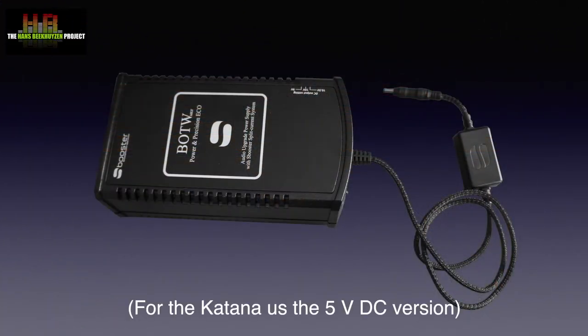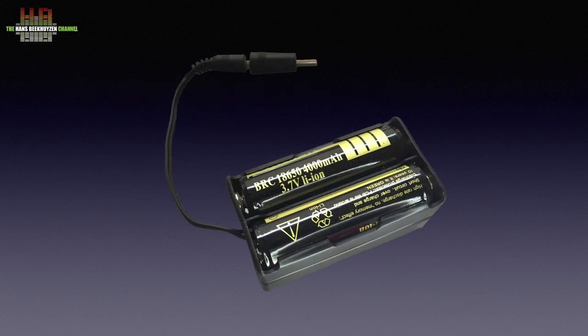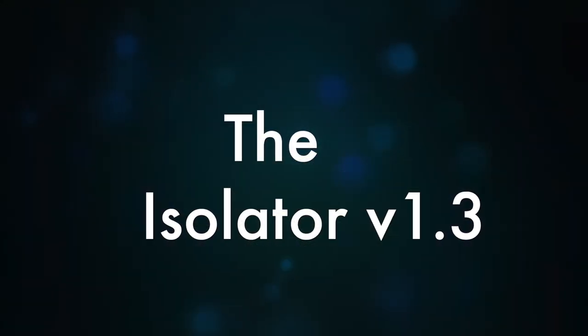Regular viewers know the importance of clean power for DA conversion and analog audio. One of the nice things about the Katana stack is that you can play around with several ways of powering it, using one to four separate power supplies — roughly one 5V DC for each board and plus and minus 15V DC for the op-amps on the analog output board. I used two power supplies: one audiophile S-Booster supply for anything audio, and one cheap switch-mode supply for the Raspberry Pi. I alternatively used the Allo battery pack holding two times two 18650 batteries. Using two power supplies isolates the power buses but not the digital buses between the Raspberry Pi and the Katana.